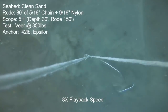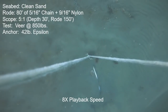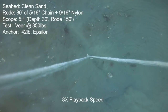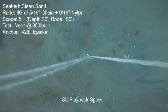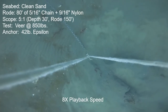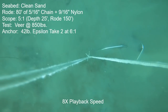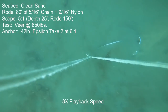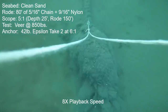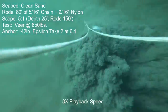Next anchor is the 42-pound Epsilon. Note that the anchor is being tested without the optional roll bar installed. On the first try the anchor sets immediately, holds the baseline of 840 pounds, and makes it through 150 degrees of veer before a full release, dragging into deeper water — so I stopped the test. I did a whole other test with 6-to-1 scope; unfortunately the anchor released at just about 5 degrees of veer, then another long drag. The seabed here is relatively free of shell, so we can't blame shells — just a poor performer in this seabed.